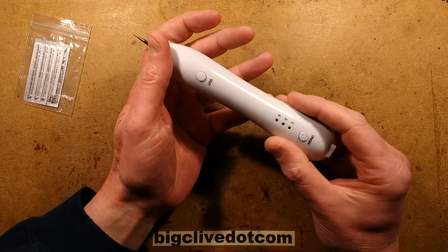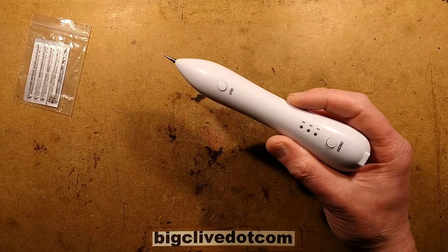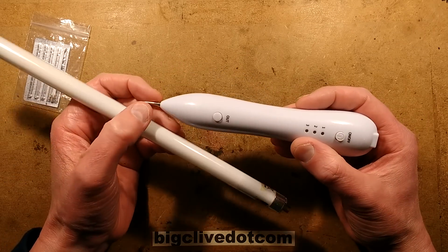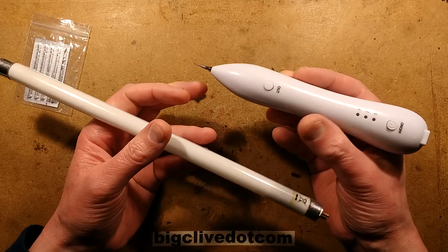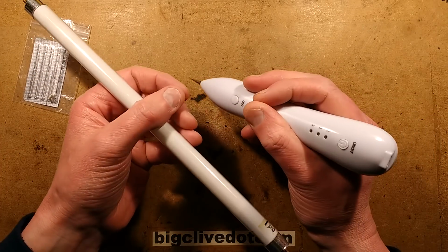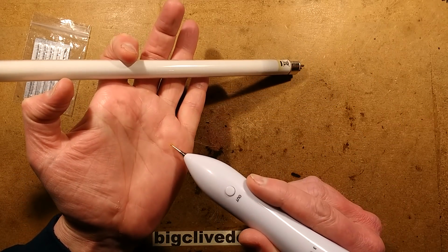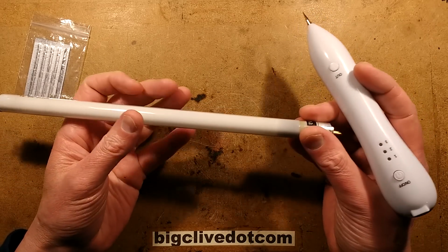Now, I have experimented in the past, like I did, with high voltage, high frequency power supplies. When I was younger, I had a whole phase of building, basically, I was trying to build a neon tube drive that would run off batteries. And I discovered the hard way that when the cable insulation isn't up to scratch, or through capacitive coupling, which this also uses, you can actually, I was handling wires and suddenly smoke started going from my fingers, and where the wires were running across the fingers, it burnt them as it has here. You can see it's gone dark there where it's burnt. And it's just the high frequency arcs burning onto the skin.